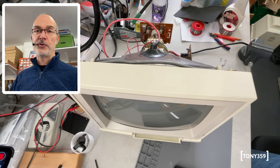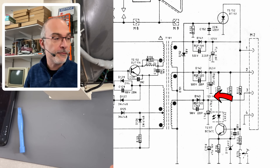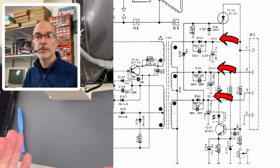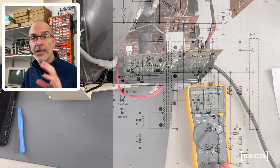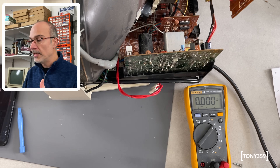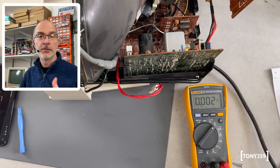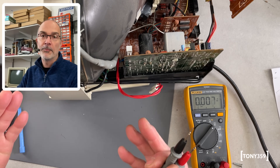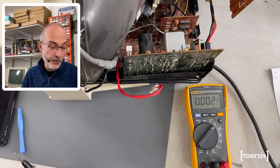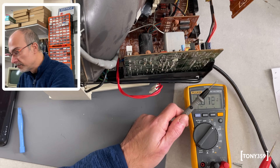Let's keep troubleshooting. The next step is to check the voltages. According to the schematics, the supply should output 15.5V, 26.5V, and 125V — with the 125V going to the flyback transformer. Last time they were all roughly halved, indicating a short somewhere. But with the power supply disconnected from the rest of the monitor, the voltages were totally fine — so there was definitely a fault downstream, which turned out to be the flyback. I'm going to power up the monitor again and check these voltages.